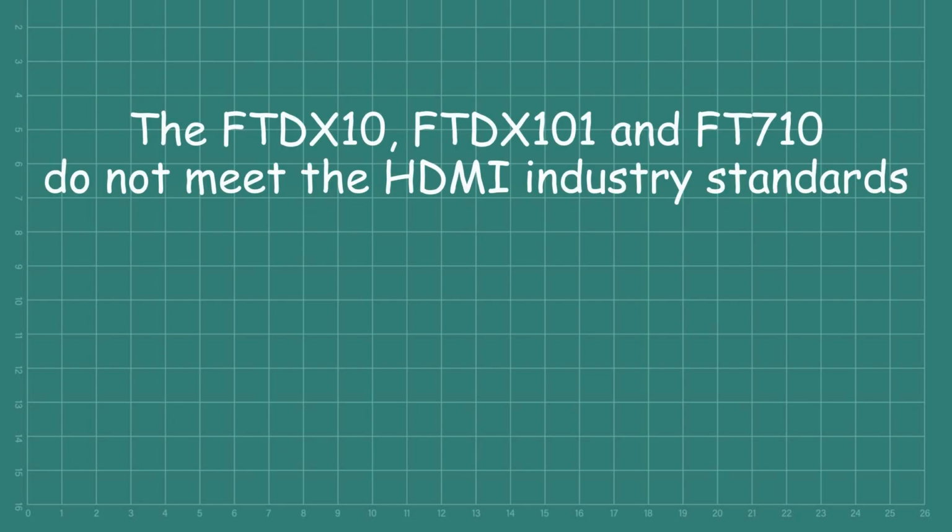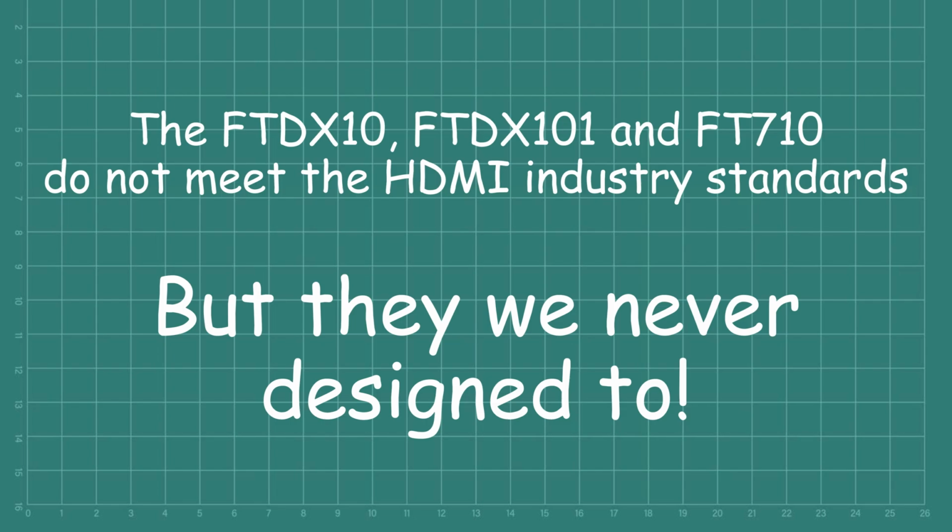One thing I can also say for certain is that the FTDX10 does not meet the HDMI standards, and looking at the schematics was not meant to. The device has been designed with a DVI-D port in mind and should not be connected to an HDMI without significant care.